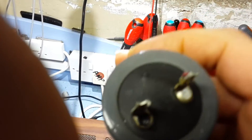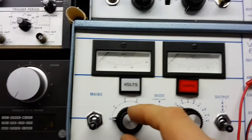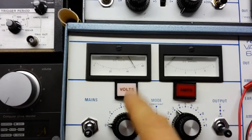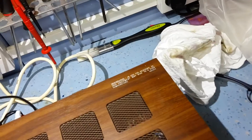Apart from the bulge, if you didn't have the bulge you wouldn't worry about it. But let me show you something when you put the voltage into it. This bench power supply has got constant current control. What I'm going to do is apply the rated 50 volts and let it wind up to 50 volts. If the current increases, it will go into constant current mode and the amp light will come on. So I'm going to connect this capacitor up and let you see what it does.